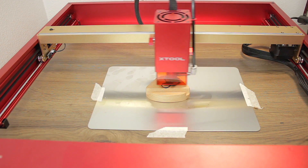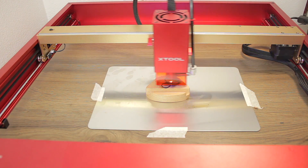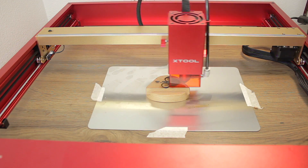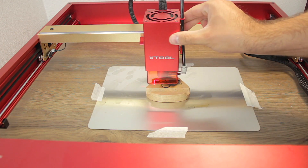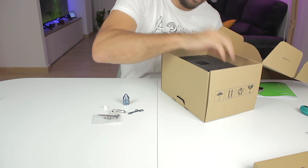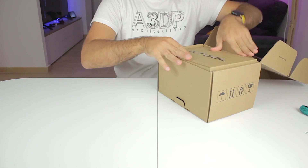To make the first test and check out how it works, I'm going to pick up an already ruined piece of wood and make the first test on it. I've started the laser work and the air compressor, and all the fumes are being blown away from the laser work area. It's working as intended and we're ready to jump to a bigger test. When the laser work finishes, remember to turn off the air pump, since there aren't any electronic connections between the laser machine and the compressor — they work independently. Before the bigger test, I'm going to put every component we didn't use back in the box to store it properly and not lose any parts.